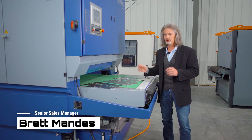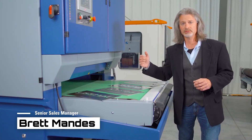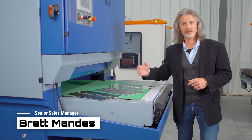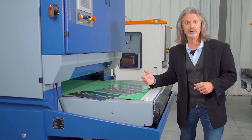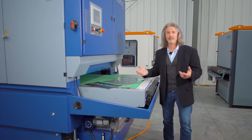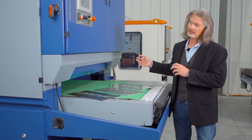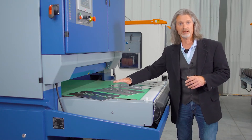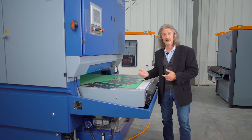This machine is suitable for a wide range of applications. If you want to grind thick material, you can do that. If you want to surface finish and deburr stainless steel and create a number 4 finish from a 2B mill, you can do that. If you want to simply deburr aluminum parts without a particular linear finish, you can do that as well. The customers who use machines like these have applications where they only need to do one side at a time, or if they have to do both sides, they are able to flip the part over because their volume allows for that.